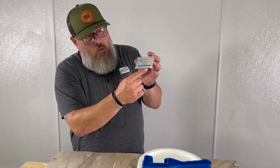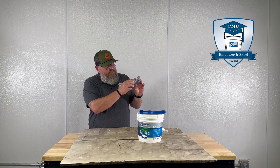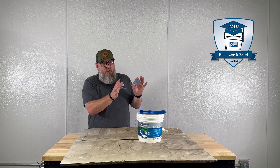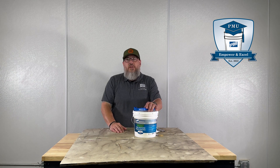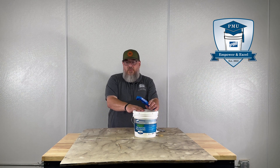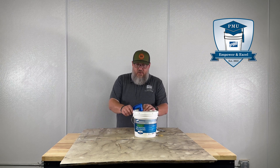In a minute, whenever we actually use it in some silicone, I'll show you how to judge where the reading is on this milgauge. The two short sides have 1 to 6 and 7 to 12. Very rarely, if ever, are you going to use those short sides. Now what we're going to do is pop open this bucket of HS3200, put a little bit down, and actually check the millage on it.